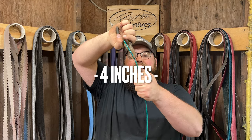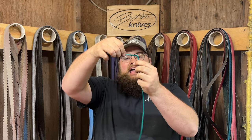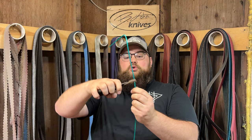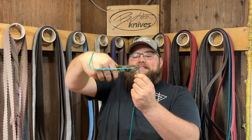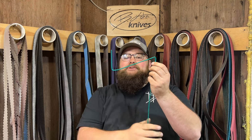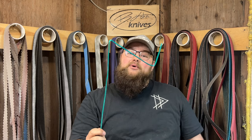Here's what we're going to need to do. First thing you're going to do is go down six inches, put a just-past-90-degree bend. Then all you have to do next is go down 12 inches and put a just-past-90 in the other direction. And boom, there's your shepherd's hook. It's the end-style shepherd's hook. It's just as effective as the other one, and it's going to get done quicker because you've got two heats instead of three, which means you can be more efficient making a bunch of these.